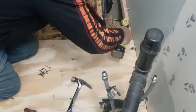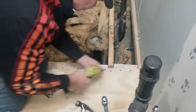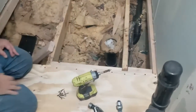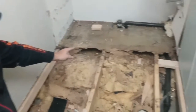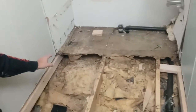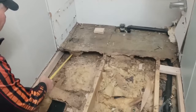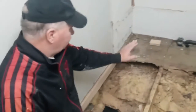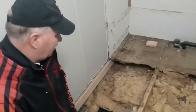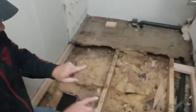That is a continual problem that I run into, two things that people do on a consistent basis. Probably because they don't know any better, maybe because they should do better, is that you don't want to put plywood over top of that particle board and then just overlay it. Because that particle board will continue to deteriorate. If you look at that, as you walk over it, this stuff will literally disappear until there's just nothing left. And you'll be having the plywood sitting on staples and nails that used to hold that particle board, and it's not anymore. So overlayment is never a good idea because it ends up wobbling around. Whatever kind of flooring you put on it, even carpet will show lines where the plywood wobbles from side to side.